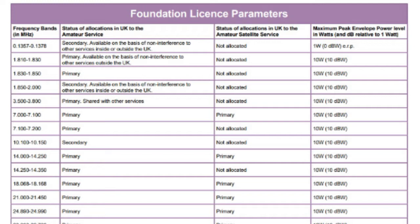You need to be familiar with how to use this particular table. The first column gives you the frequencies. The second column confirms whether that frequency band can be used by radio amateurs and whether it's on a primary or secondary basis. Primary means the frequency range is allocated first to radio amateurs. Secondary means we're sharing it with other users who may be the primary user. Obviously primary gets priority. The third column shows whether the frequency range can be used for amateur radio satellite, and the fourth column covers the maximum available power you can transmit for those frequencies.